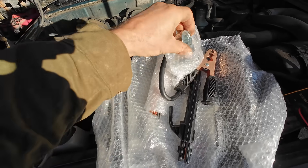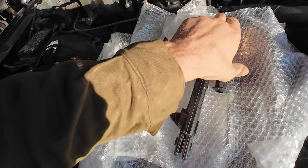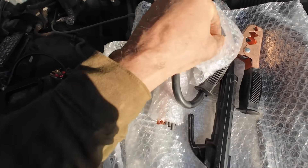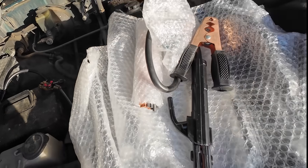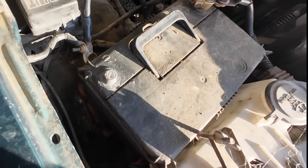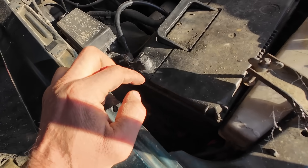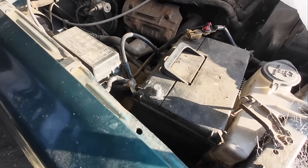I've got this kit — it has castings here for the poles. What you do is connect this to one terminal and use these rods to melt the lead and make a new pole. That's the lead there. Not sure how it's going to work, but it's definitely worth a try because this battery is spitting out battery acid and it's going to dry out if I keep using it like that. Also because the pole is eroded it's not getting very good contact. So I'll give the battery a bit of a clean up and get any corrosion off that pole.